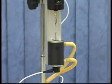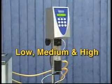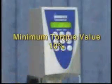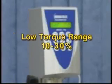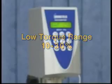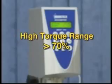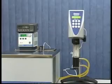The 13R chamber we are using supports a temperature probe allowing for temperature monitoring at the instrument. Based on the spindle you will be using, select three speeds that will give you a low, medium, and high torque value. The minimum torque value for a good reading is 10 percent. A low torque range would be 10 to 30 percent, a medium range 30 to 70 percent, and a high torque range above 70 percent. This will check the linearity of the spring on this instrument through its full range.